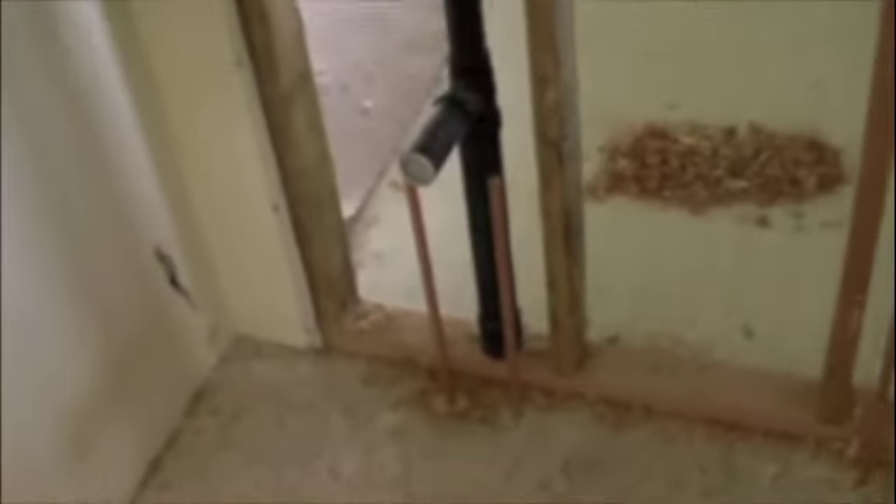I think we're all set. It was good to have another set of hands around today for sure — it made this go fast, which was great. So I can just fill in the joists with some hangers, no problem. The other thing that happened today is pretty exciting — in your powder room here, I've gone ahead and framed the walls. We've got a rough-in for your toilet and the angle stop coming out of the floor. We patched into the drain, no problem. We also have a rough-in for your vanity or pedestal sink, and we've got the vent pipes running straight up.